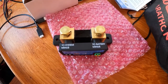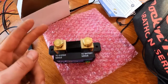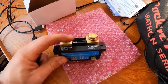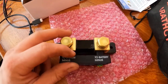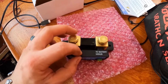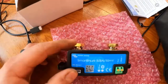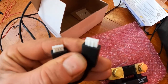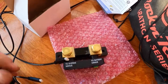With this smart shunt, the ground battery cable will come up through here, and you basically put new ends on it and run it through here, so it measures the current going through that ground. This one is actually called a smart shunt — it is Bluetooth, it's got a little circuit board on the side, and it's Bluetooth straight to your phone. So if you just wanted to monitor your batteries through your phone, you could, just off this for the DC side. I'm going to use the VE direct cable route — I'll run a cord, which you have to order separately, and that will plug manually into the Cerbo and add to that part of the system.